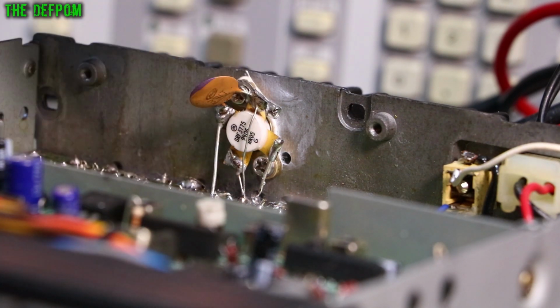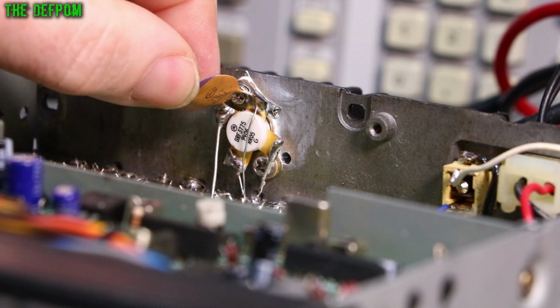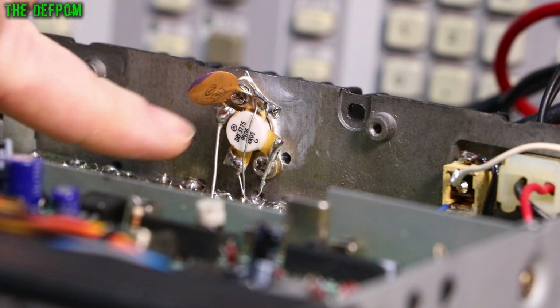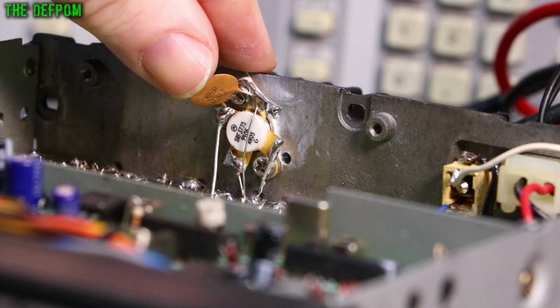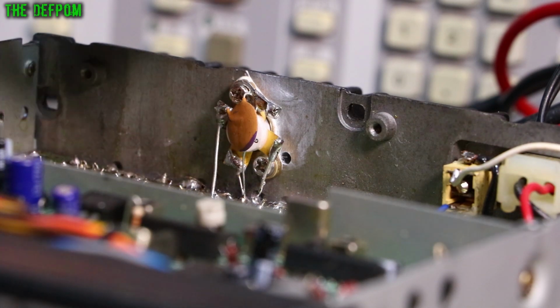So you have to wire both of those up. That one there is the collector, that one there is the base. And across here as well is a 330 picofarad capacitor between the base and the 0 volt side of it on the transistor, just to help get rid of any self-resonance and self-oscillation. So you do that modification. It ain't pretty, but it works.